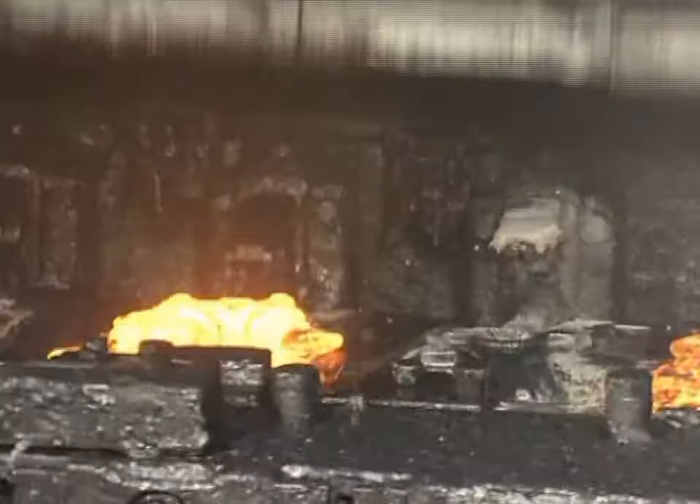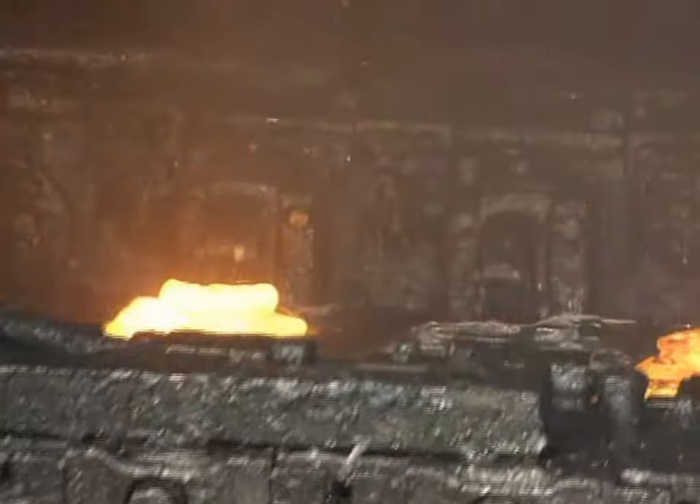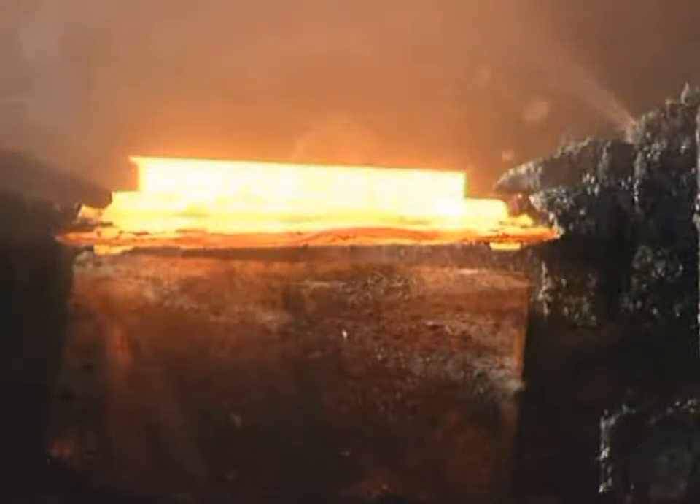The thin flash cools rapidly, increasing pressure within the impression, which assists metal flow in the impression details. Once finish forging is complete, the flash is removed either manually or with trimming dies.